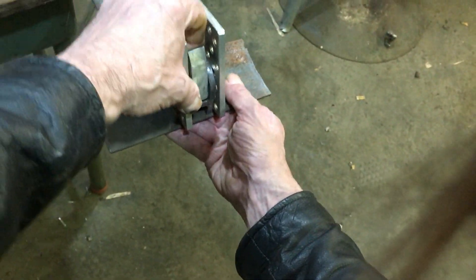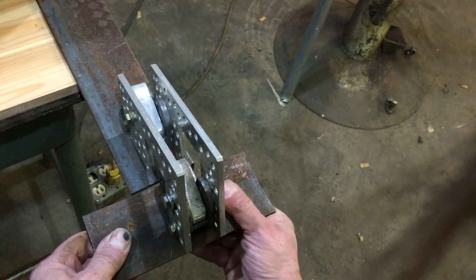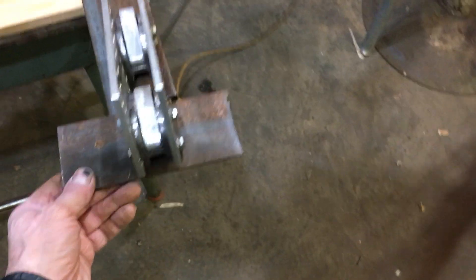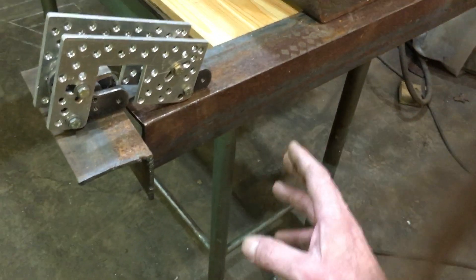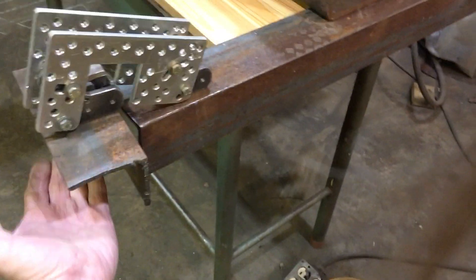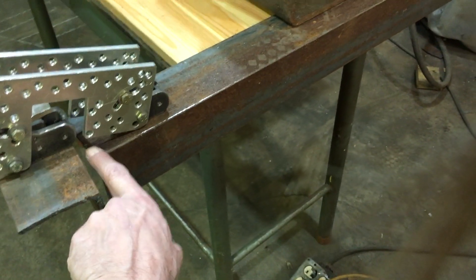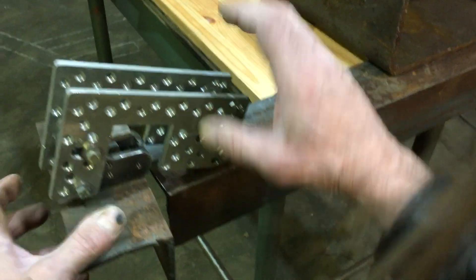The next things are pretty standard magnets — I made these myself. If you pull this lever up, it becomes a very weak magnet that you can put on and off, and if you push it down it becomes very strong, simply moving the magnet in and out of the material. A lot of people make magnets, but they don't make magnets that you can set in these odd ways. A very common thing in structural are frames for openings on roofs and ceilings that hang on trusses and have to be offset by anywhere from a quarter, three eighths, maybe a half inch on big stuff. This can be set up for any of those.